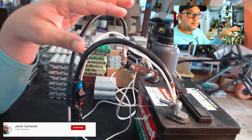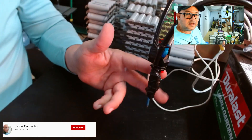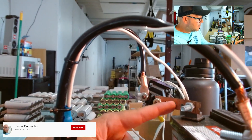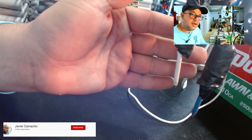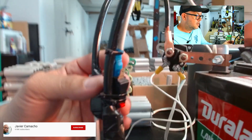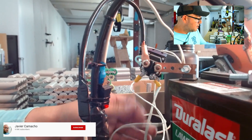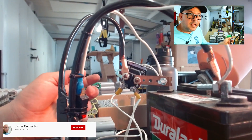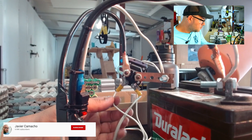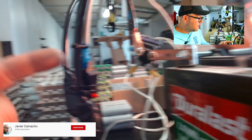So the main cable is connected to the positive — this is where I have my relay. On the negative I have my solenoid, which is connected to a copper bar and also connected to the cable going to my electrode — this is quite warm right now. My relay is basically connecting the two cables that are connected to the solenoid: one for each terminal. It doesn't matter which way you connect them, all it needs is to get energized — so every time you push the relay it gets energized.